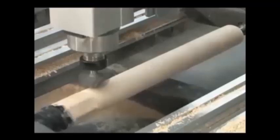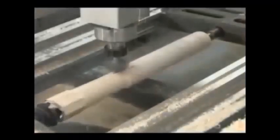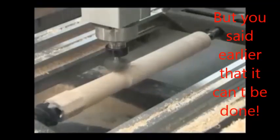With a 4-axis system, you'll need to program the Z-axis to lower as it makes the cut to provide the taper. The problem is that you will usually resort to using a round nose or core box cutter and set a very small step over, resulting in a slow process similar to carving that requires more sanding.